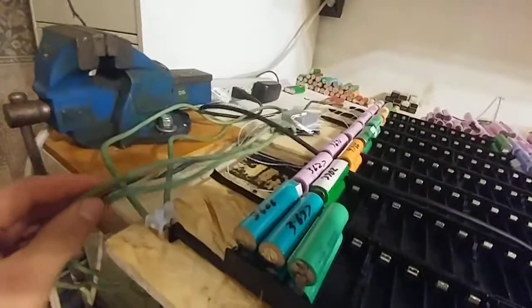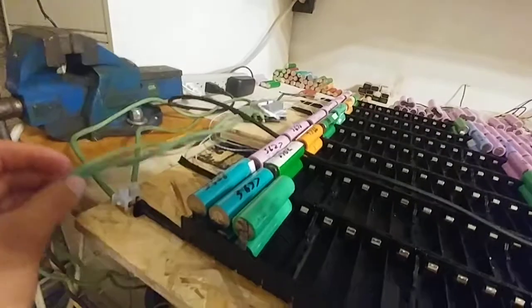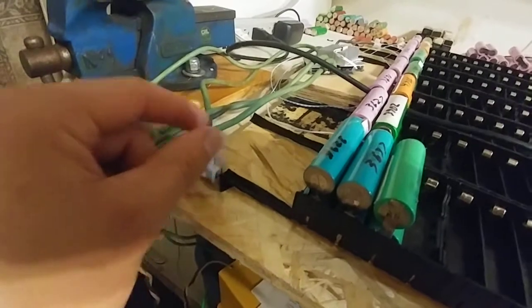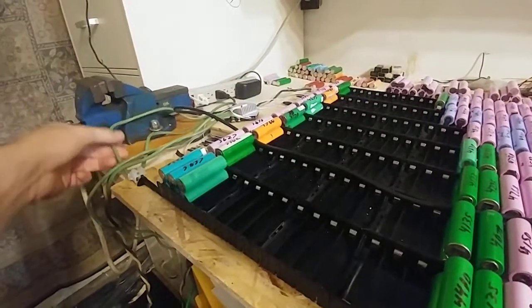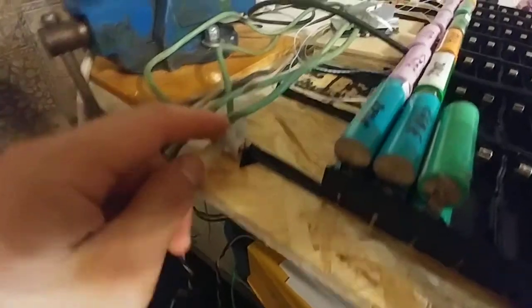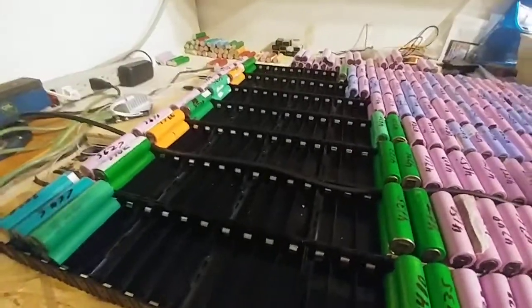Another thing is I was able to solder in these big thick braided cables. I think my heating problem is at these connectors here — if I soldered this to the wire here instead of just pressure contact, the heat buildup would not be nearly as severe. It gets slightly warm. Also, if I had all the wires soldered together in one ball instead of separated — one wire to each connector — I doubt there'd be as much heat buildup.